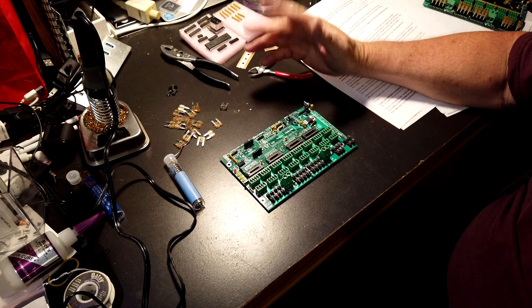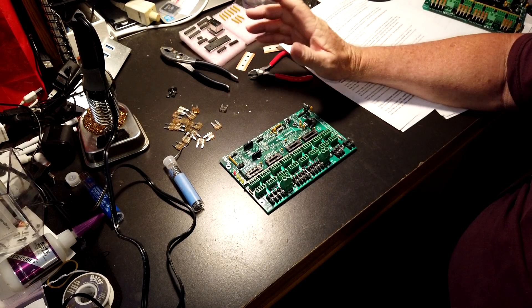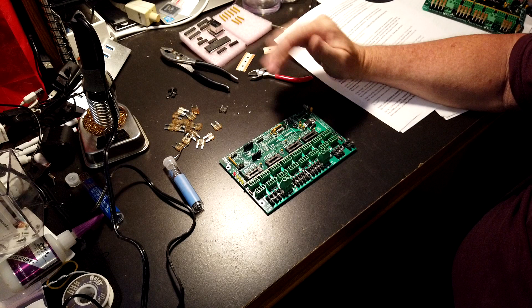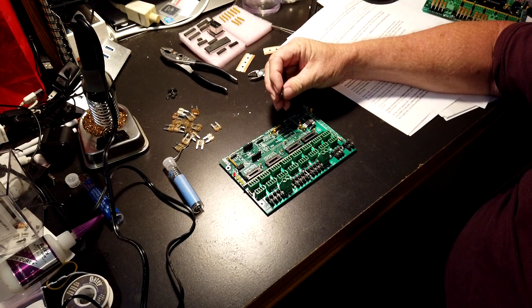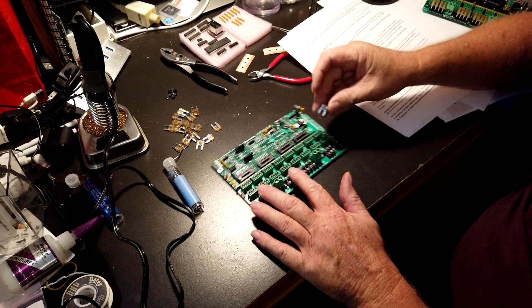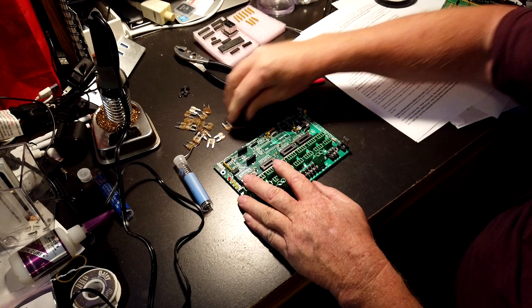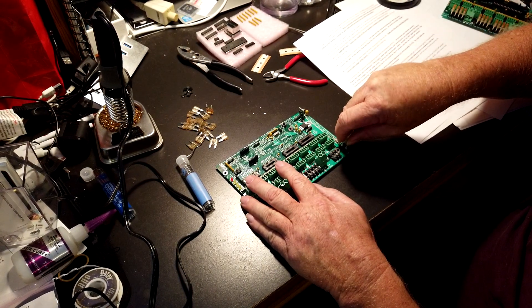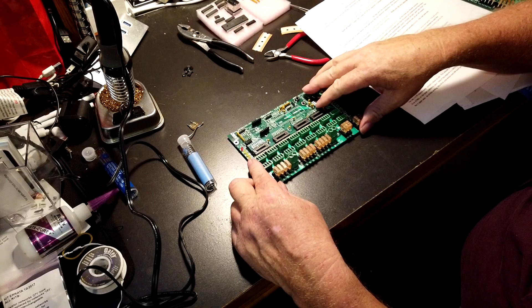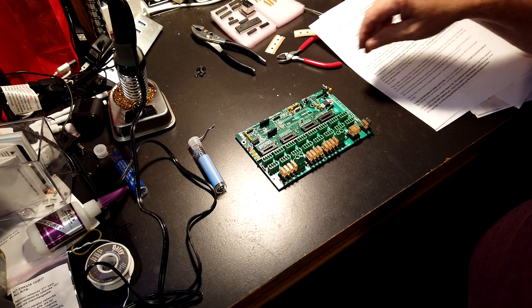If you're satisfied that all your solder joints look good, that they're all attached well and don't have any bridges, then you move on. This is where you add your fuses. The smoke-colored gray one goes all the way in the right-hand side. The rest of them all just fill up the rest of the slots. There's all the fuses. Extra fuse — put it over on its side.